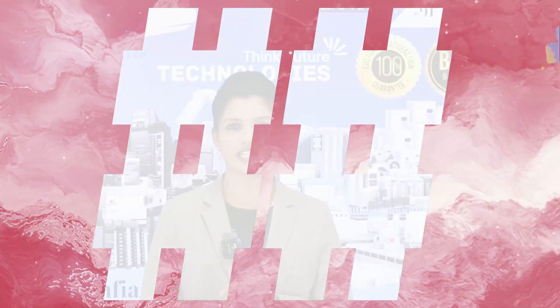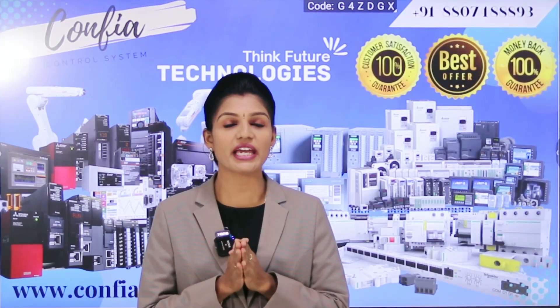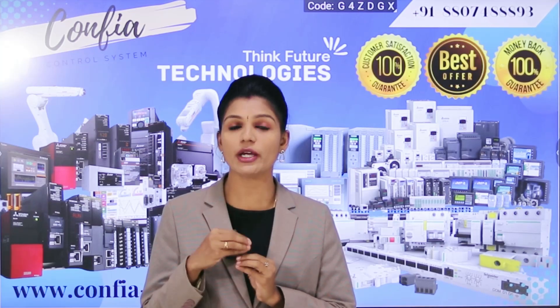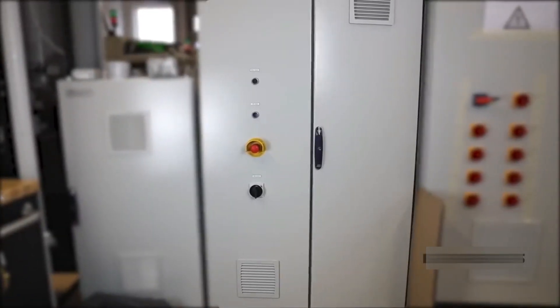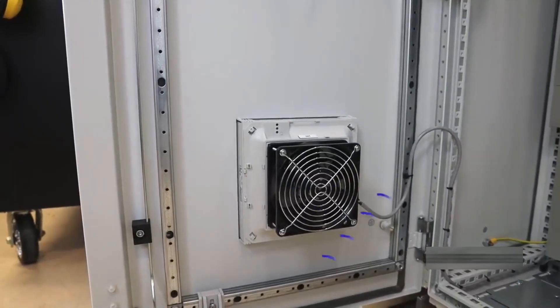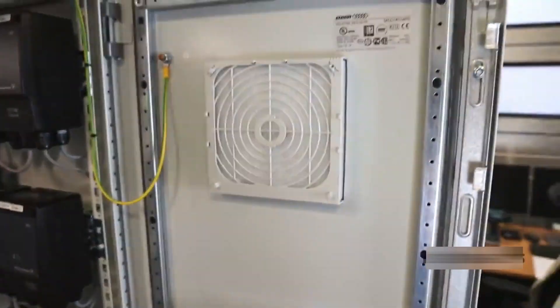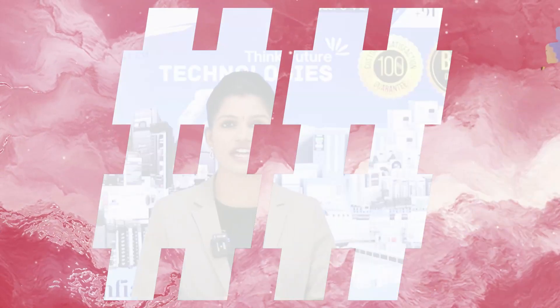The fifth tip is verifying the cooling system. If your PLC panel box has a cooling fan or ventilation system, make sure they are working properly. Regularly clean the fan and make sure it is not obstructed by any object in the front or back, because if the cooling system fails, the components will automatically heat up and this may cause malfunctions in the PLC panel box.